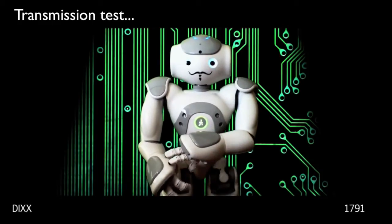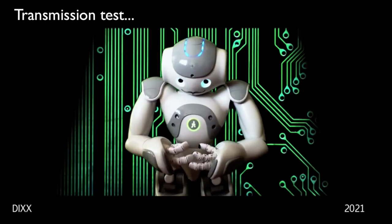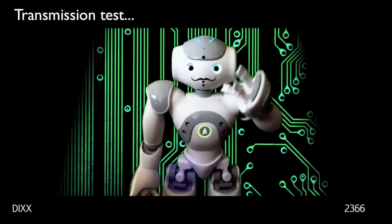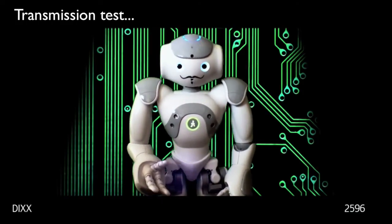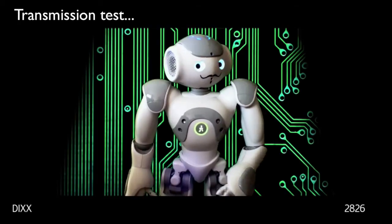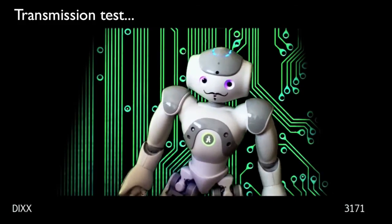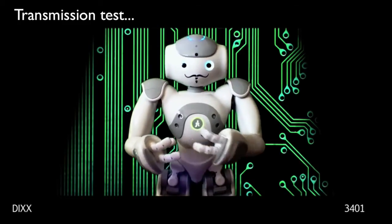Counting every articulation in my body, I have 25 degrees of freedom. The sonar is located in my torso, allowing me to detect obstacles that I might encounter. My 2 cameras give me an enlarged field of vision. Thanks to them, I can look right in front of me, or at my feet, to avoid walking where I should not. The 4 microphones around my head allow me to detect the origin of sounds nearby. There are 4 force-sensitive resistors under each of my feet. Combined with my inertial sensor, they help me keep my balance. I can use my LEDs to express various emotions and interact with you.